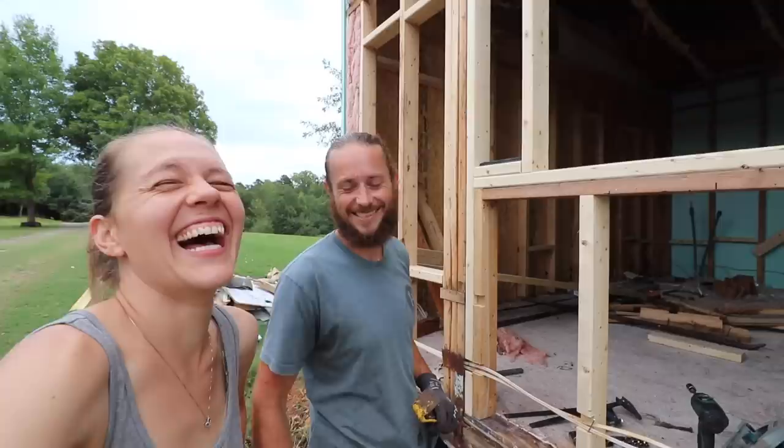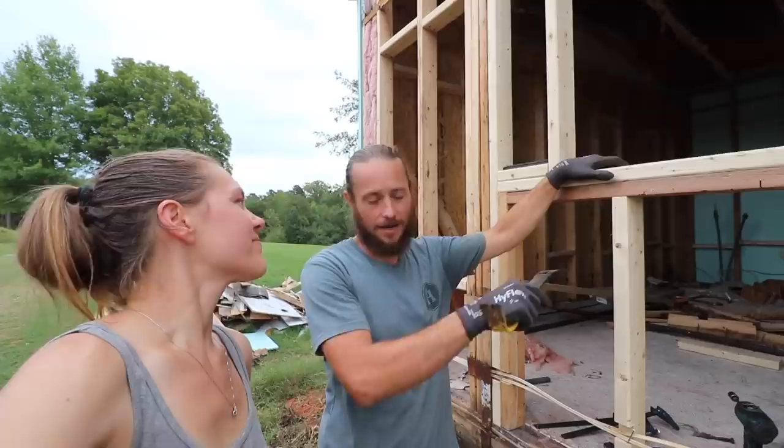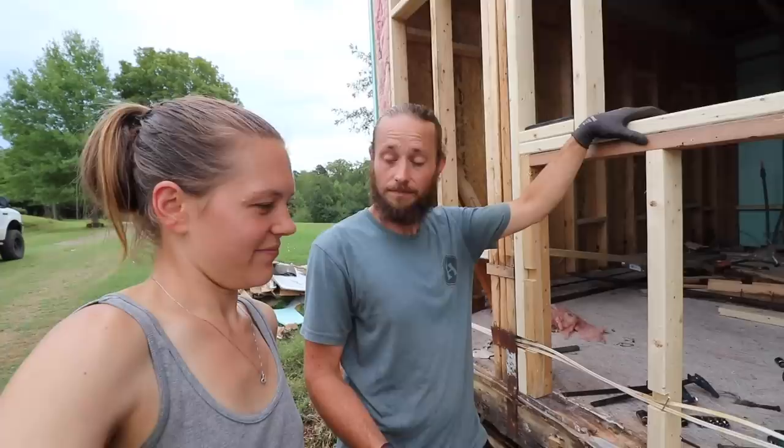So, anywhere there was something attached or a window directly under it is rotten. So there's a deck up front, deck on the back. There was this window, all the windows were particularly bad. The windows were not really installed very well. They just put caulking on. There's no flashing of any kind. Yeah. So now I'm ripping pieces out and scabbing it back together.